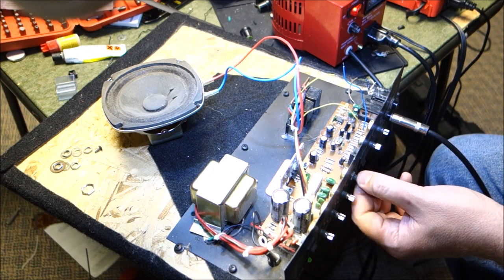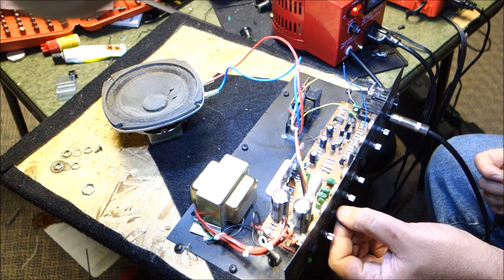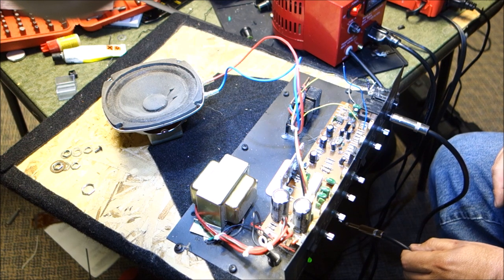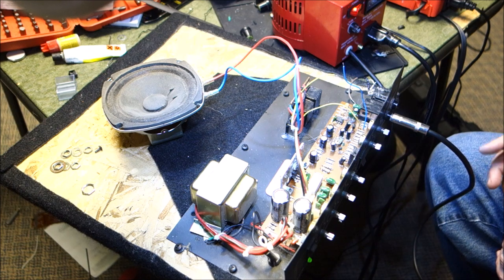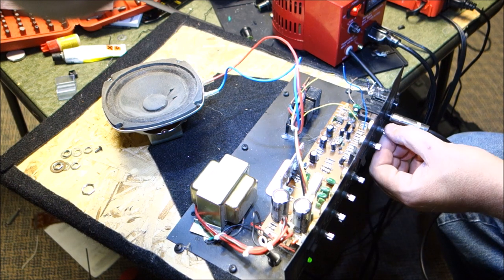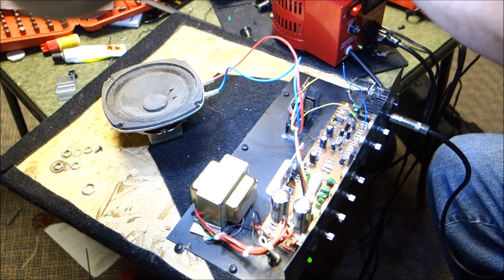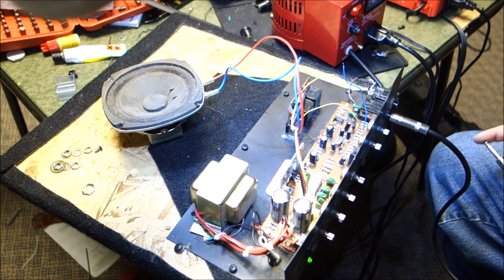Let's see what our input does. It's working. Those pots are fizzy and need cleaned real bad. It's working. Let's give it some more volts. We went up to 78 volts. I had the gain pretty high. As I'm bringing the voltage up, it's getting louder. It doesn't look like anything's blowing up. Other than the preamp pot being absolutely horribly filthy, and not having any of these screwed down is leaving it with a lack of a ground. There's about 105 volts — let's just go up to 110. That's pretty much full voltage, and it's working. It's amplifying my noise.